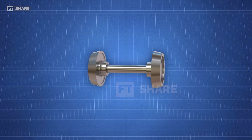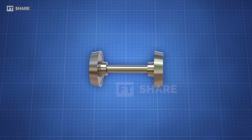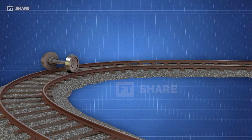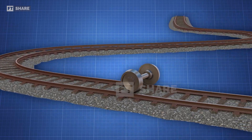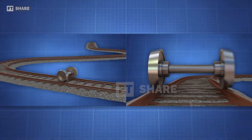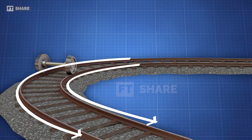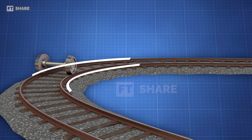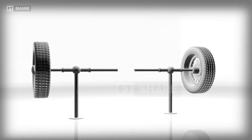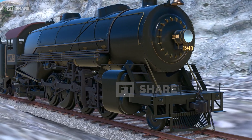So, what do you think? Isn't that a pretty cool technique? Now let's chat about why engineers give a conical shape to train wheels. The reason is that this shape allows for differential action. Just picture this — a train needs to turn, so the left wheel has to travel a longer distance than the right wheel. But since the wheels are connected by the same axle, how can one wheel travel a greater distance than the other? This is where the conical shape really comes into its own. To get a turn, the wheels will just nudge to the left a little. If we think about where the wheels touch the ground, the left wheel has a bigger circle than the right wheel. In short, the left wheel will cover a greater distance for the same angular rotation — which is what we call differential action. To get differential action in cars, engineers have to separate the wheels and rotate them at different speeds. But on trains, they get the same effect by giving the wheels a conical shape.